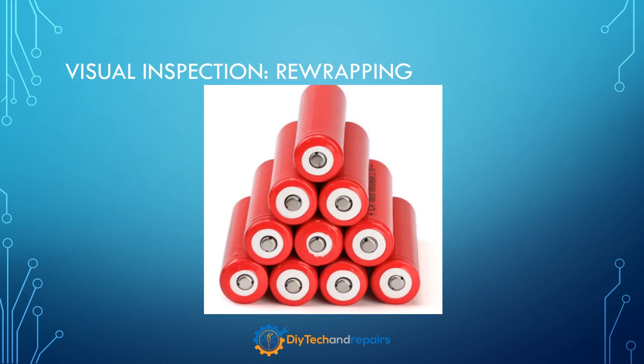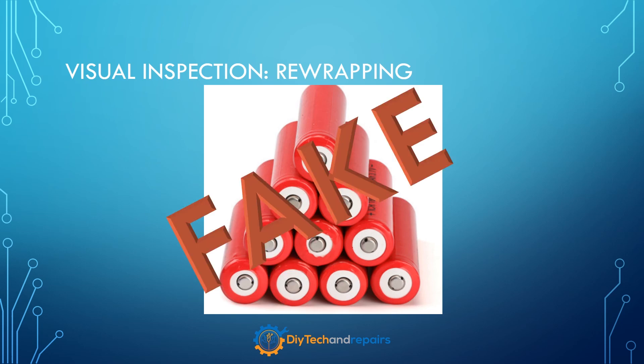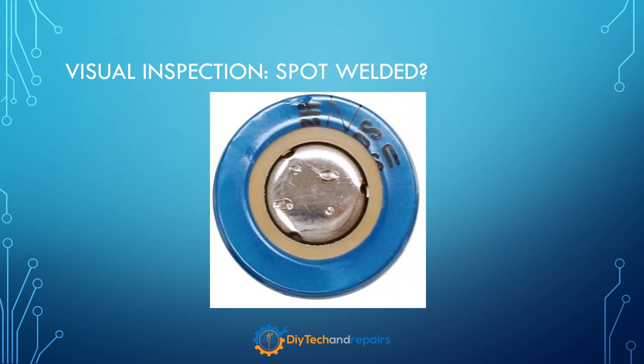If we just check the cells you can see another very common thing, and that is re-wrapping on second-hand cells — they do that to be able to sell them as new cells. In the image here you will see a re-wrapped cell that is not very nice looking, and this is just a bad example of a job that screams fake cells. Visual inspection can also show you if the cells have been used before — for instance, this image shows a cell that has spot-weld marks in the middle, four of them to be precise. If they are selling the cells as new and you see this, they are most likely picked out of a bigger pack, and I would consider this a fake cell.